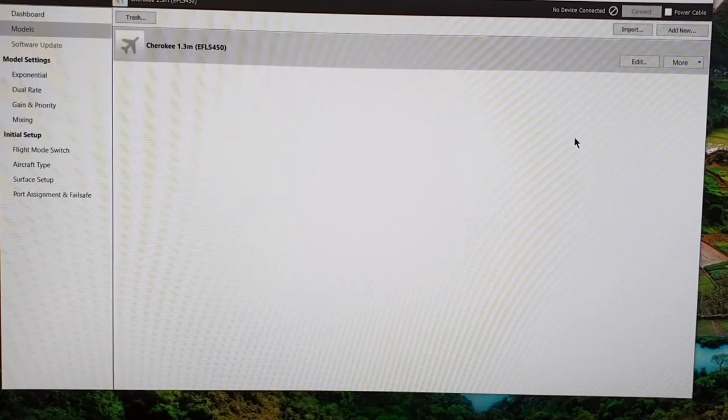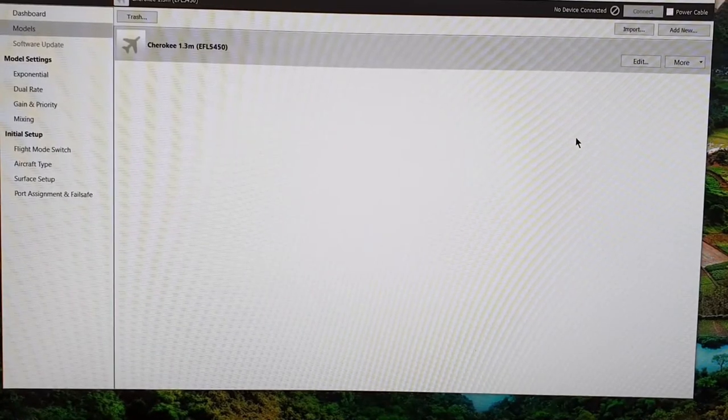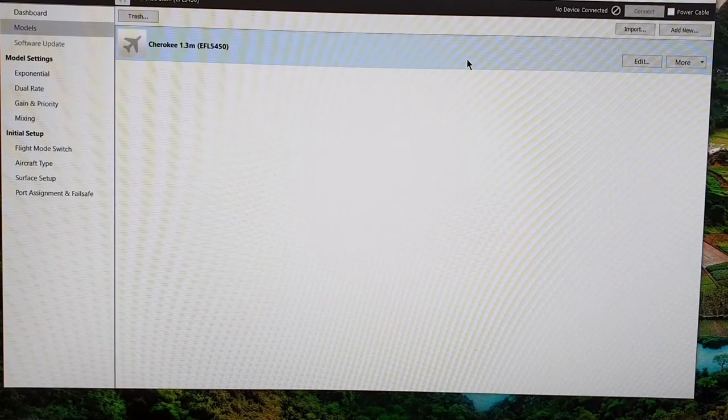So this is how I enabled Safe and AS3X on the AR636 Spektrum receiver in a Hobby King plug and fly plane. The first step was to find a model that is enabled on the Spektrum website, and that closely resembles the plane that you want to use the AR636 in with Safe and AS3X. So I found one that was very similar, the Cherokee 1.3 meter, and there's the model number there. So you import that into the Spektrum program